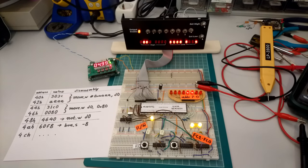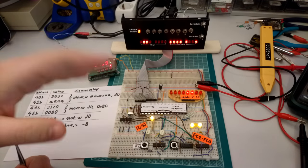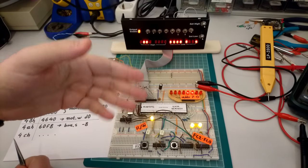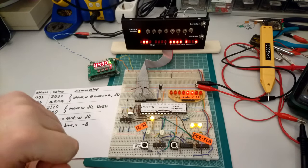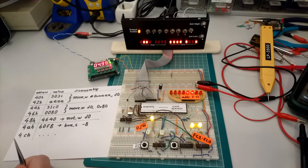Address 0C is exactly the interrupt vector that corresponds to the address error exception. So what it was going to do afterwards, if we continued in this fashion, is read the address of the exception handler and then jump to that point in memory. There's obviously no point in continuing this, but it was quite instructive, I think, to see what happens when an exception is raised.